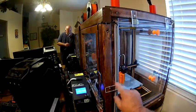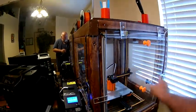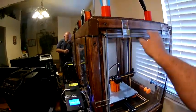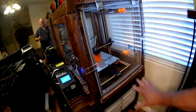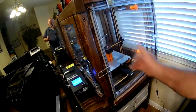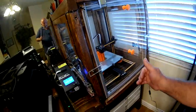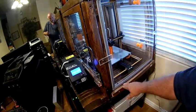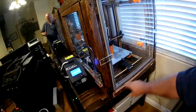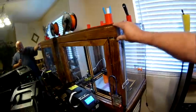I have a screw here as a stop so it stays in position. To open it, I flip up these two latches, flip these out of the way, take two hands, grab it, and lift it up off the track down here. The only real problem I had is that once I set the printer in place and slid the bed back and forth, my adjustment knobs up front were hitting my 2x3 material. So I had to cut down part of my frame in the front right inside the door.